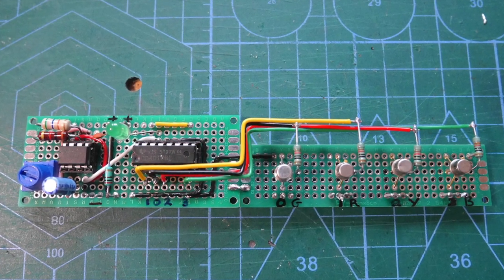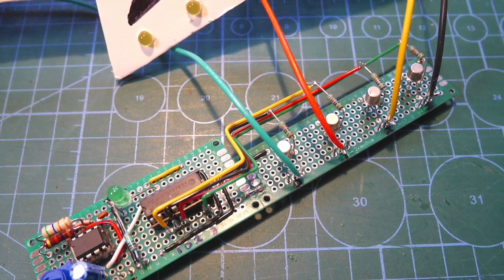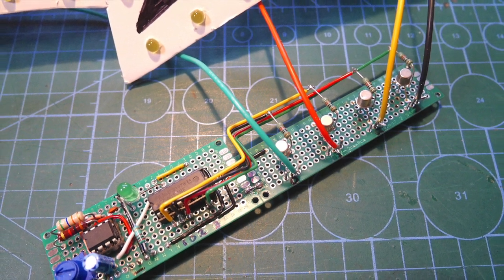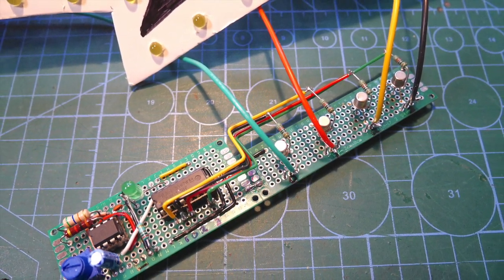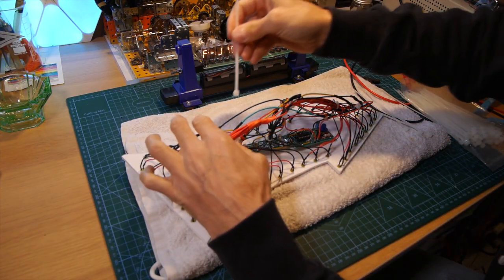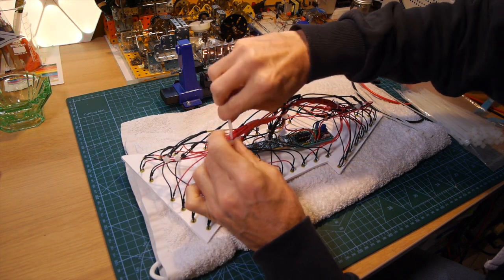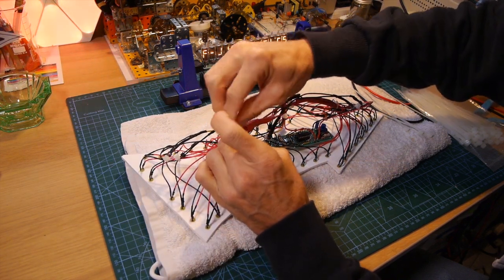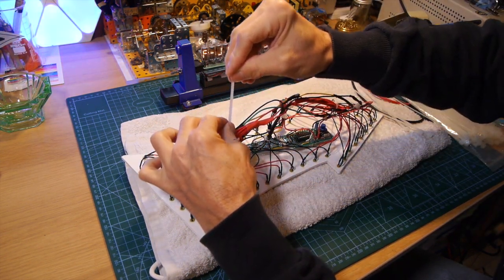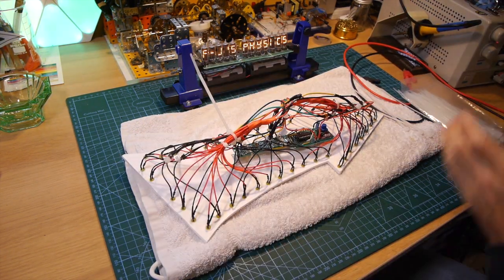With the circuit boards built and joined together, I could now wire up the parallel groups of 4 LEDs back to the BC108s and the 4017 light chaser circuit, hoping the sequence was wired up correctly. I then mounted the sequencer driver circuit onto the back of the sign with some sticky cable tie bases, and I did a bit of work to tidy up the wiring. I had no intention of making it look really neat or have it flush with the back of the sign.